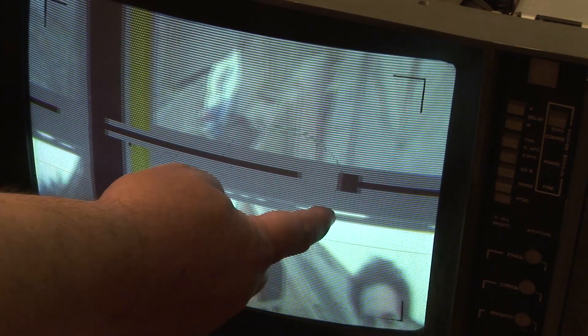Let's look at this through the time-base corrector. Pretty much gone. This is just the time-base corrector — notice that our color stripe signal is gone, and our macrovision signals are gone. I could take this DVD, run it through this time-base corrector, and make a perfect quality analog copy without having to rip it or anything — just plug it into my DVD recorder and make a really good quality copy using only the time-base corrector.